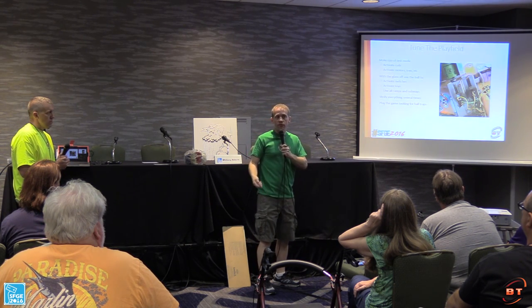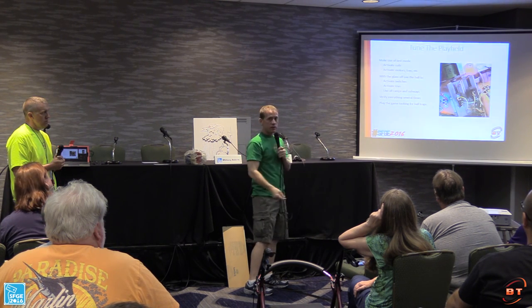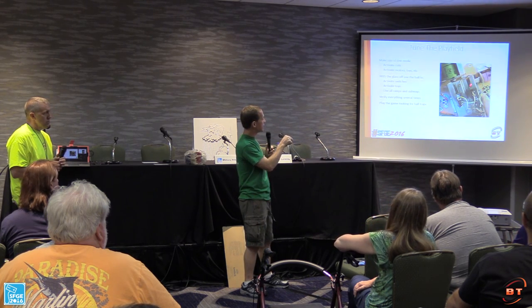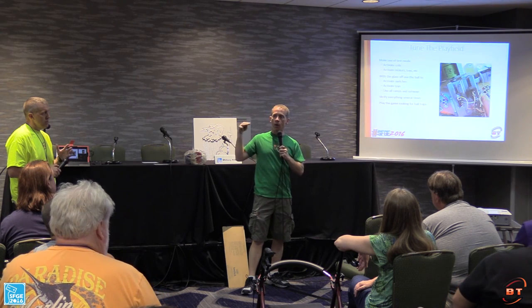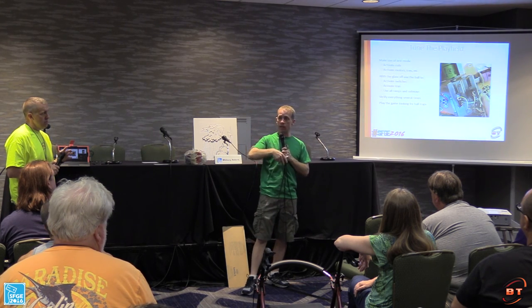It took me 10 seconds to fix it, but I had to play the game and look for a ball trap to find it. And so you'll find that. Just play the game and see where balls are getting hung up, what needs adjustment. I've had situations like in the subway on the Addams Family where I had a washer in the wrong place and the ball would get wedged between the subway and the play field. Had to open it up and take it all apart.